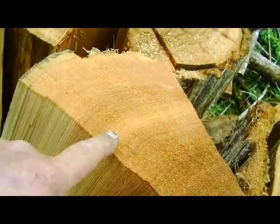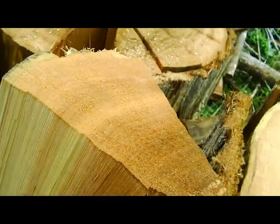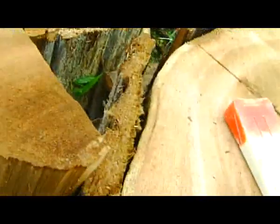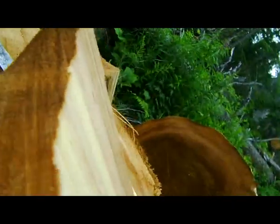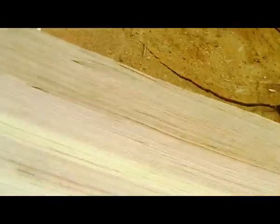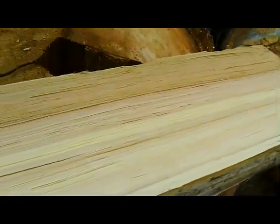The chunk I got yielded this piece. Now we are going from here to there, harvesting that for sides and neck. In this chunk here will be left for a harp guitar. Let's see what we can get out of there — this piece here will give me two sets of sides and a neck blank, a laminated neck of course.